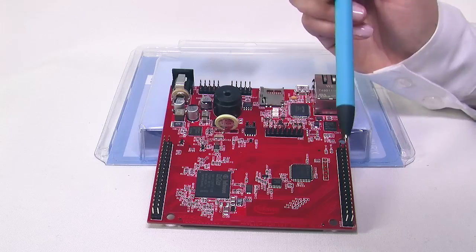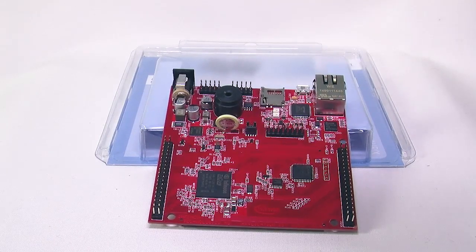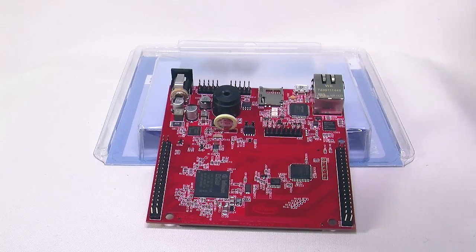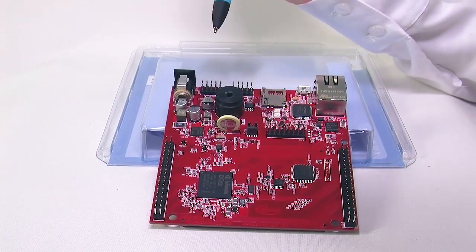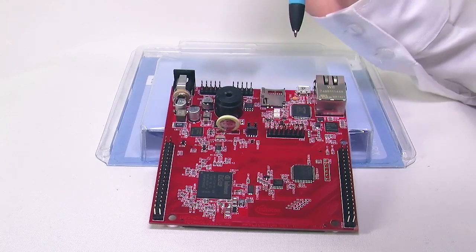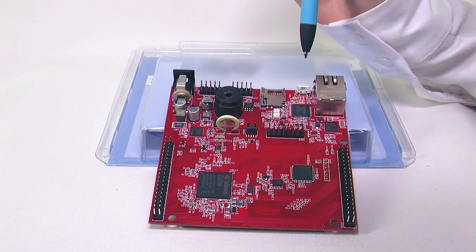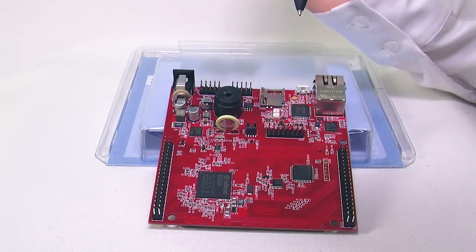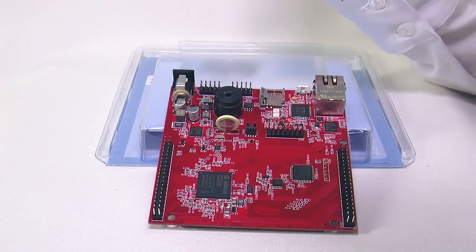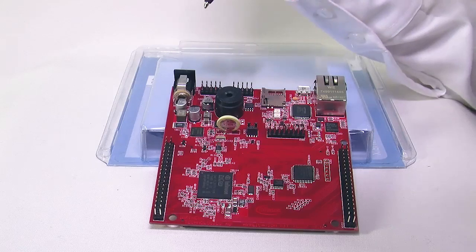Here you can access the main pins of the microcontroller, where you can connect your sensors or any other components. In addition to the microcontroller, there is a set of peripherals embedded in the board, such as the header for LIN and CAN Infineon transceivers, a slot for the microSD card, a microUSB connected to the miniWiggler for easy debugging, and a connector to Ethernet.